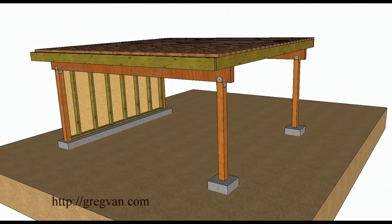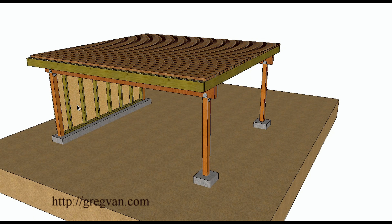Something like this would really create a nice sturdy deck. You might also consider adding another wall, because one wall is not going to do it. At a minimum I would say have one wall on one side and one on the other side, creating lateral strength in each direction. This wall here would help the deck in this direction, and that wall would help in the other direction — together they create a nice strong lateral resistance.